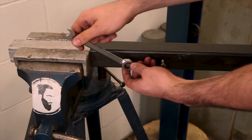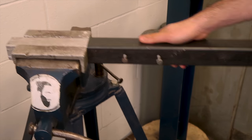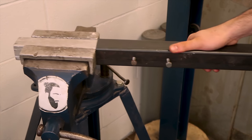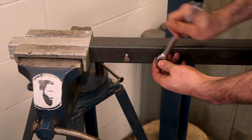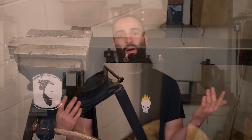Then, to lock the arms, I just need a couple of bolts, and thanks to the precise fit between aluminum bar and steel tubing, that's all I need to make everything nice, secure, and very solid. Of course, these bars are not perfect, but if you have any source of scrap aluminum, they are pretty much free to make. And the big advantage is that you can make them in any size and length, and they will always fit very precisely the tubing that they have been cast into.